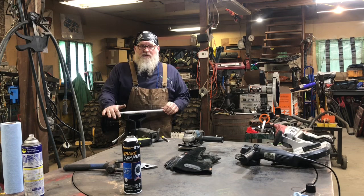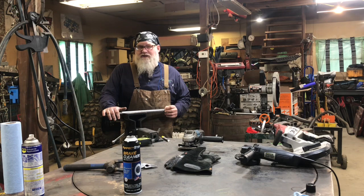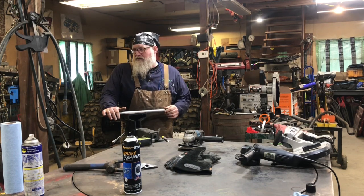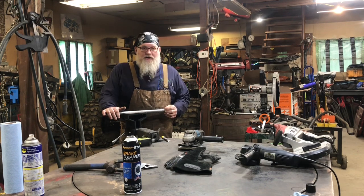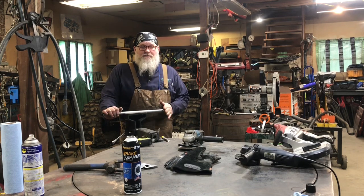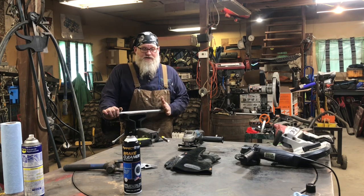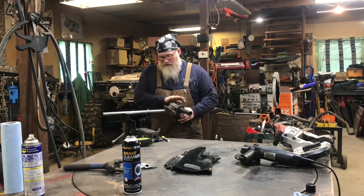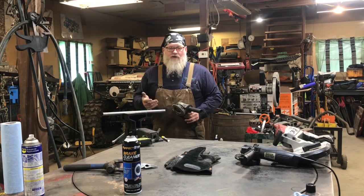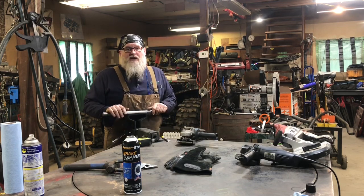So the first thing I'm gonna do, the bottom end of this tube is pretty much just hitting straight on into the 1.5 inch. So with 1-inch tube going into the larger diameter tube with the 1.5 inch rub rails, you're not going to get a full fish mouth. So what I'm going to do is work the top of the tube here at the end, and take some material off just using the grinder roughly, straight up and down at an angle, and I'll roll the tube 180 and do that again. All I'm doing is trying to make it fit a little bit better.